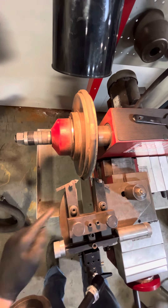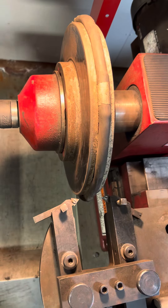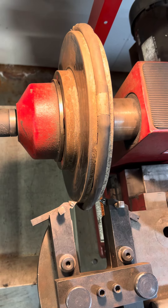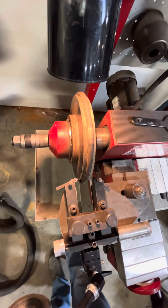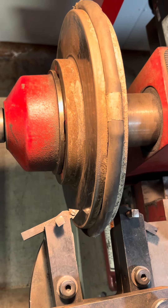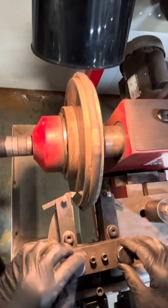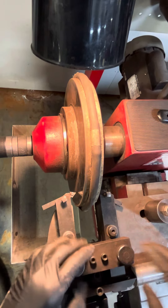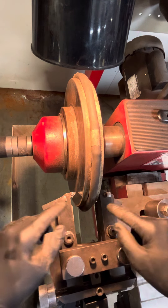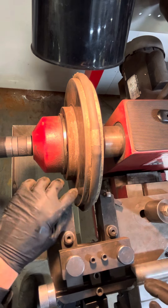I'm close and I'm going to hit there, so I'm going to move this side out. I like that — pretty good. So now I'm going to drive this in. This handle next to me is the one that's driving it in. That looks really even — the tip, you can see the reflection in there, it looks even on both sides. I'm just going to softly tighten up these little retaining nuts, just a little bit of tension on this bar. Those tips look good, but we'll have to rotate those every maybe 10 to 15 cuts or so, then we'll get a new sharp tip.